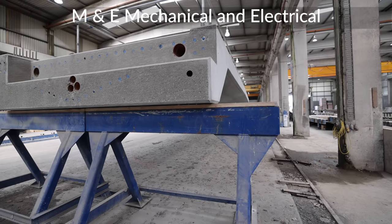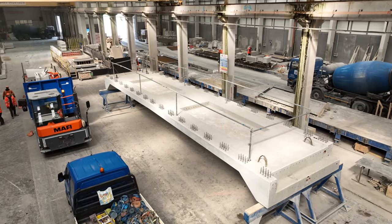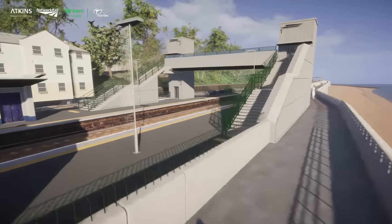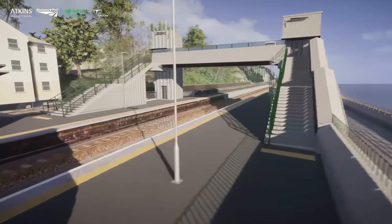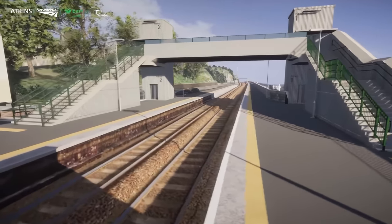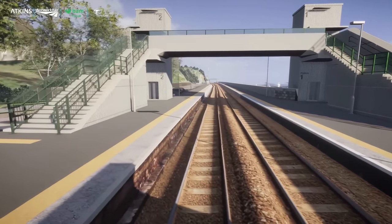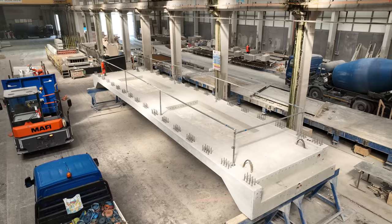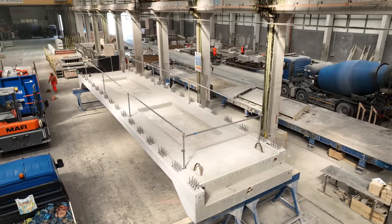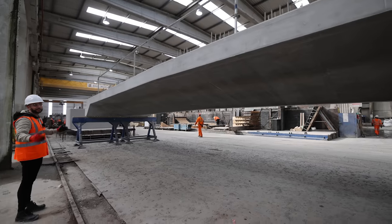On top of the edge of this bridge there's not going to be an open parapet like there is on the link bridge — there's a solid stainless steel parapet with a 300mm glazing panel on top, about 1.5 metres high from where you see the bolts. There are 272 bolts cast into that deck, and Fergal has the challenging task of getting them all in the right position so that when Stoneman Engineering come on site to fit the balustrade it fits — especially with the sloping gradient into the middle.